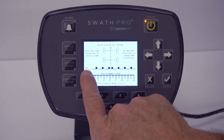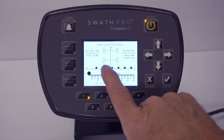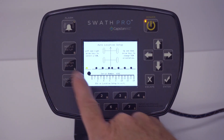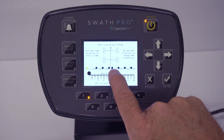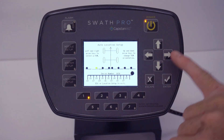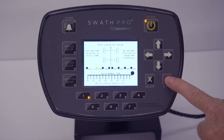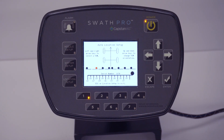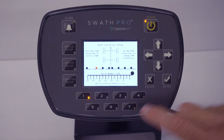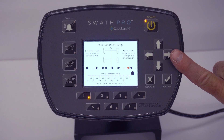You can stop it and flip it if needed. The yellow dots or black circles from the center to the left all need to be on the left side; from the center to the right, all need to be facing right. Let's go to number two — hit the left or right arrow to go to VCM number two. Hit the Enter button. That is location number seven physically on the plane, so with it pulsing, scroll over to location seven on the screen.